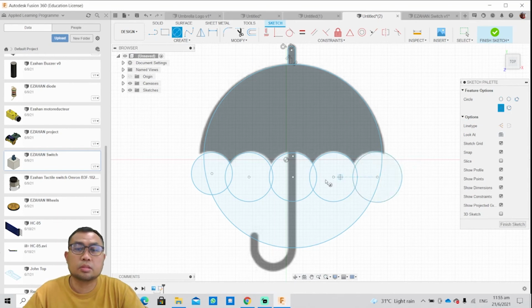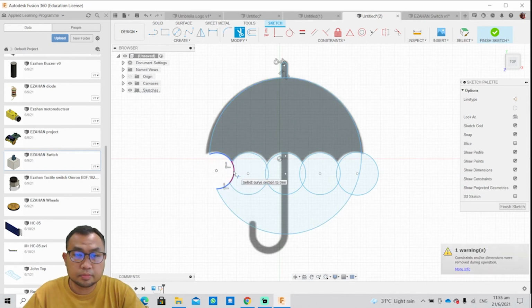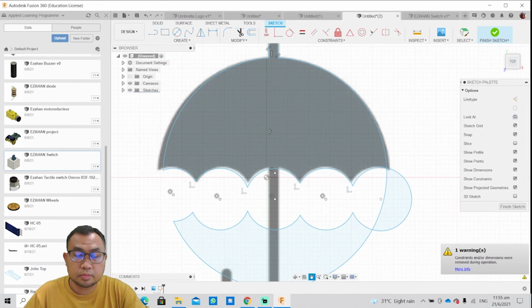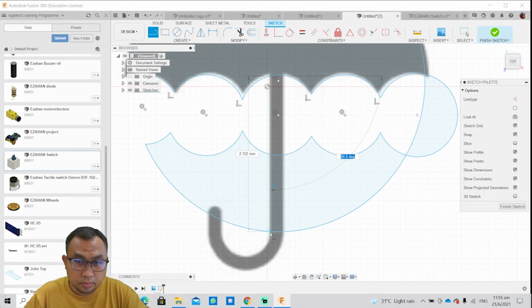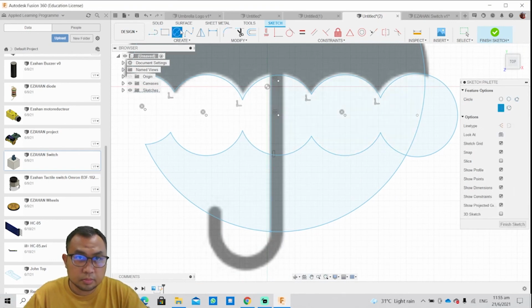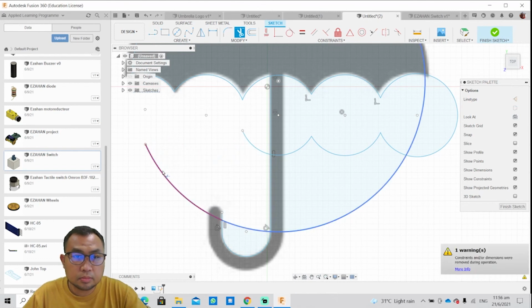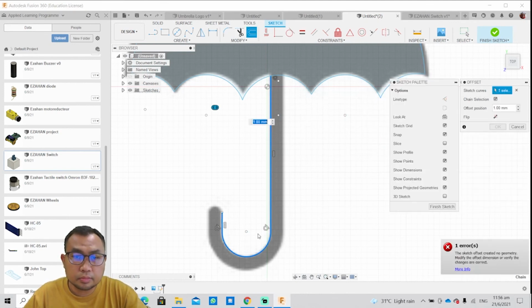Okay, so furthermore, the DXF file also appears as transparent on Inkscape, or I would say any software that you are using to laser cut, whereas an image file will overlap the work area. So let's say you scale the image up big, you might not be able to tell whether it's sitting nicely on the location that you want it to be. So the DXF file is transparent except for the line, so you are able to position the cut boundary where you want it to be.